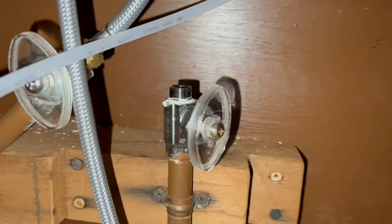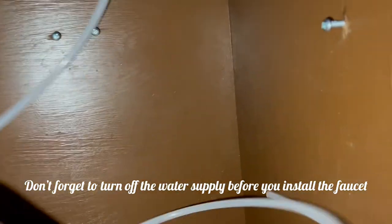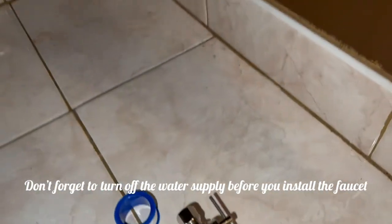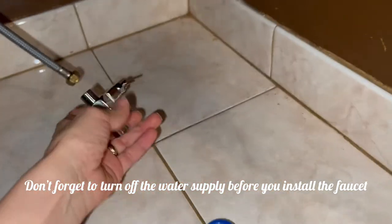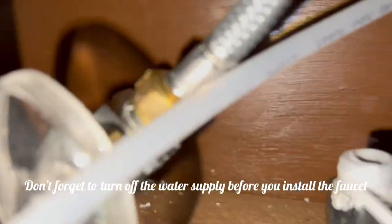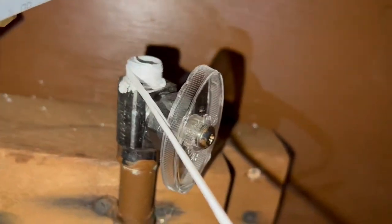This is the area where the cold water is going, so be sure this is the cold water line. I already have this set out right here, because in that area we are going to connect the adapter assembly. Always remember to put white tape — that is included in the kit — for a secure connection, and be sure you are connecting to the cold water line.